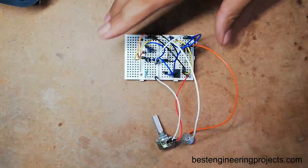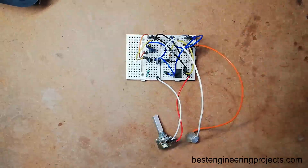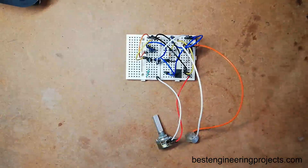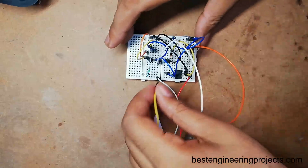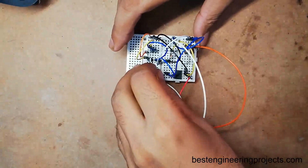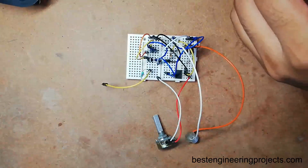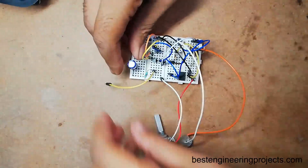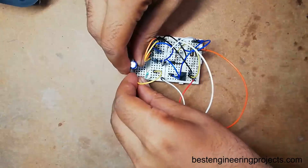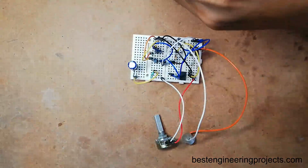Now all that is configured. At last, one end of the feedback resistor R5 is connected to the output of capacitor C2. C2 must be 470 microfarad. I am connecting it here, and from the negative terminal I am going to connect the loudspeaker.